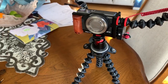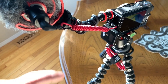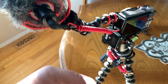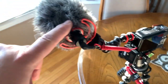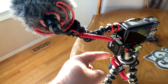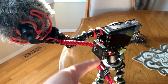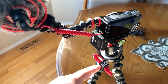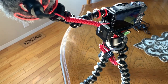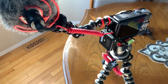When I first set this up I thought, I'm going to just split the audio. But the problem is — and I don't know why — one of the audios will be super low, and it's usually this one. This one seems to be fine. My theory is that this is powered and this is passive. I'm going to try getting a splitter that turns one into right audio and one into left audio, so I can adjust the gain on one channel to bring it up, and then do the same for the other. Maybe I can get it to balance that way. That's a theory yet to be proven.